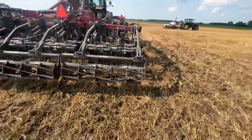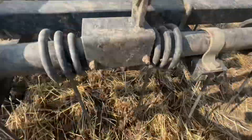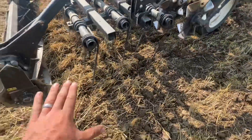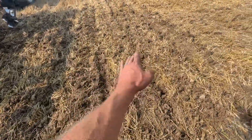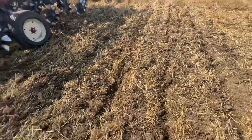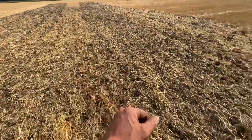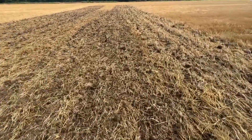The Versatile Southford has got adjustment on this harrow tine — we set these more aggressive. These tines are completely responsible for how level and smooth our seedbed is. You can see there was a divot from the shanks; we weren't getting enough drag to fill in between. So we tightened them up, and now this is the finish we're seeing in this center pass — and on this pass too, you can't even tell where the shanks ran. Really nice and mellow.